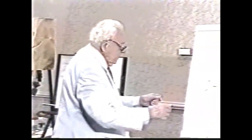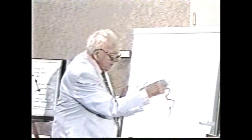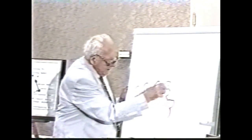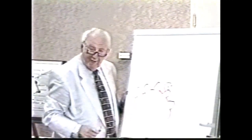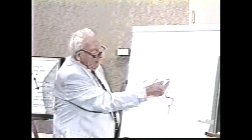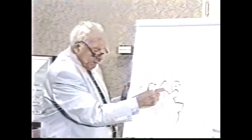However, sometimes the toothed count wheel is being driven not by a regular pinion, but by a lantern pinion. You can imagine a lantern pinion over here, and this is the shroud of the lantern pinion, and there's one of the trundle wires. I remember trundle wires, it's a hard word for me to remember. One of the trundle wires projecting out of the shroud of the lantern pinion is going to drive this count wheel in this direction, by moving down in between the teeth and pushing against the next tooth and moving it and pushing against the next. But it's going to bunk into the top of the tooth over here.